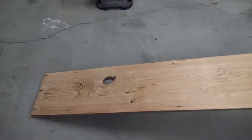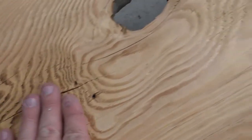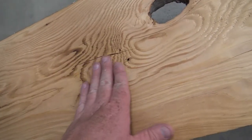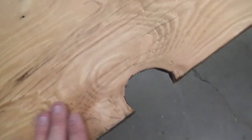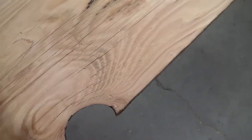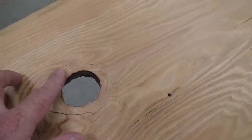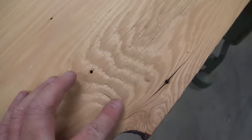This here looks like it's going against the grain — maybe I ought to flip it around again. Maybe how I had it originally was better, to cut with the grain so it cuts smoother. This is turning out to be one stubborn piece of wood. Within one pass already it's looking better, but I still need to go over it a couple more times. It just depends on what part of the plank you're looking at — here the grain goes with the blade, here it does not. So you kind of have to pick your battle.